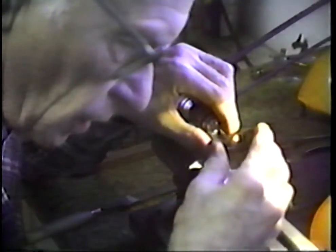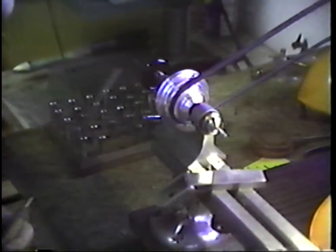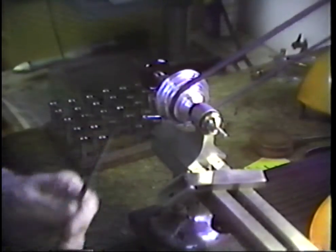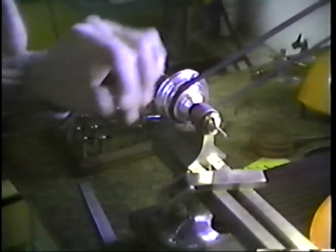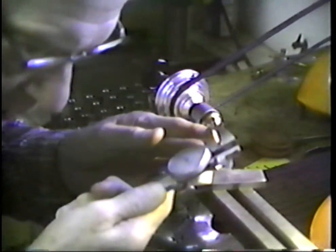One of the problems that we have in this technique is that you cannot be absolutely sure of your measurement, because when you're deliberately cutting a rough cut, you're measuring at the top of the burr. And I want this to be a little bit rough from the standpoint of getting the best friction interference fit in this. Try again.